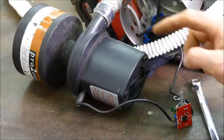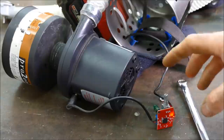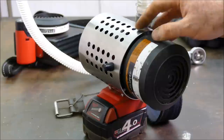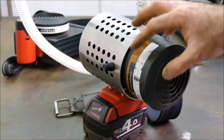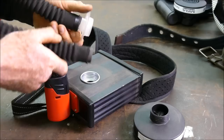The other concern is these are only meant to run for five minutes, but that's on full power. We don't want full power — we want just a tiny amount, around five to eight volts, as opposed to the full 12 volts. I can't guarantee this is 100% safe, but is it better than using no respirator? I would definitely think so. The filter is the most important part — if you're pulling air through a good filter and delivering it to your lungs, that can only be a good thing.